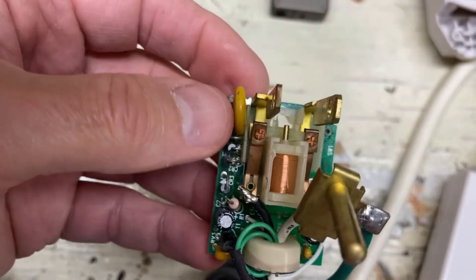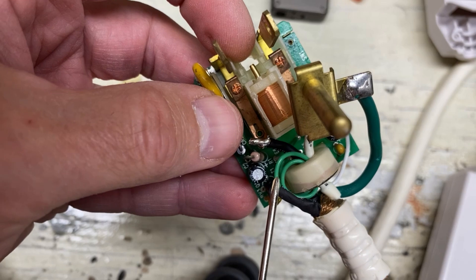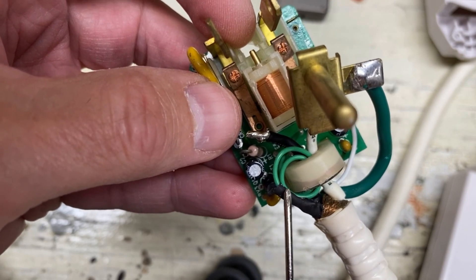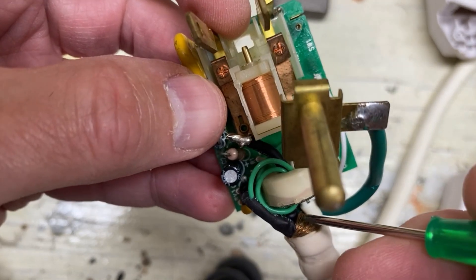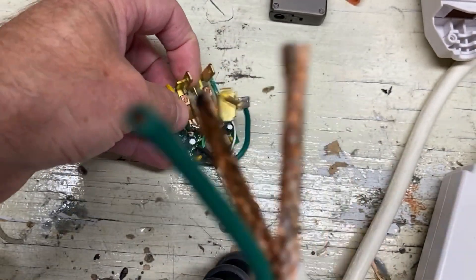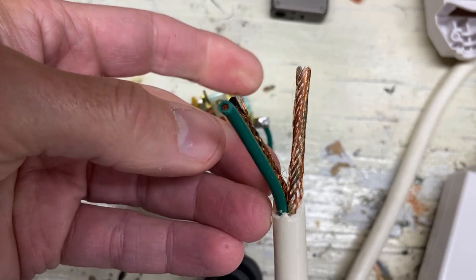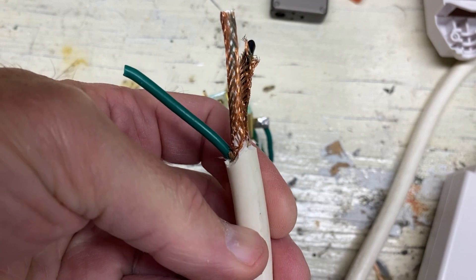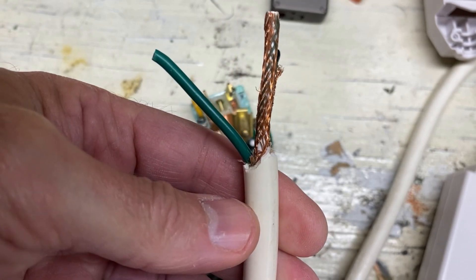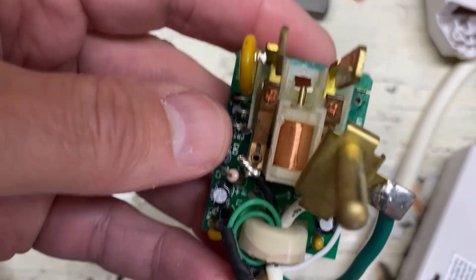Pretty fascinating. One thing that was surprising — an interesting discovery — what is this green wire? Well, the green wire passes multiple times through, and that gives a multiplying effect to whatever current it senses. Now, it connects back to what looks like a shield. I thought these power cables are not normally shielded. Well, when I stripped the conductors, lo and behold, they are shielded. The only thing I can guess is maybe if there is a cut in this cable, or a ridiculously large amount of electromagnetic interference, then some current might flow through that shield and trip this device.